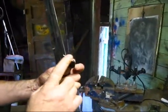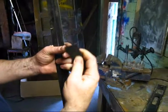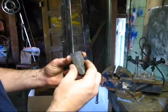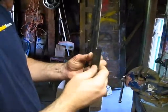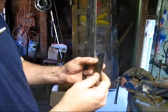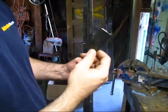A quick note on forging 4340 — it's basically air hardening. When I busted this off, the grain was ultra fine and I hadn't normalized it yet, which meant that it hardened as it cooled off. This is very important because you don't want to mess around outside the forging temps with this type of steel, because if you cold work it like that, when it hardens, it'll just shatter.